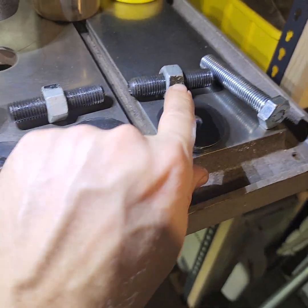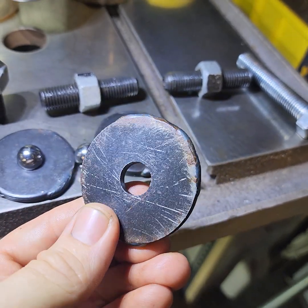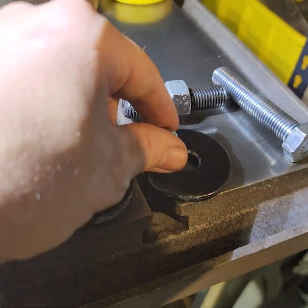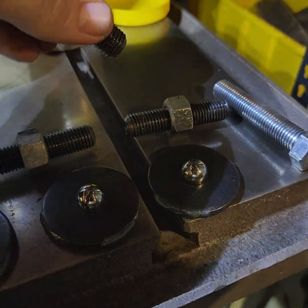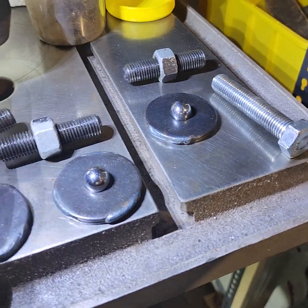The washers are double thickness and welded, then stoned on the bottom and chamfered on the top, and they hold the ball quite nicely. These have a cap on the end so they sit there and are quite smooth on the hardened ball, and I just wind them up.